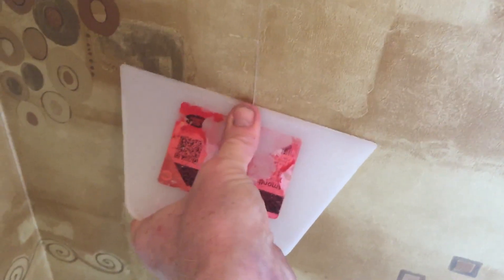I could use a wallpaper seam roller, but I'm using my thumb right here — it does the same thing. You can see the glue came out; you want to even the surface out. If you have too much glue in there, your seam will be repaired but it will be jutting out, and you don't want that.